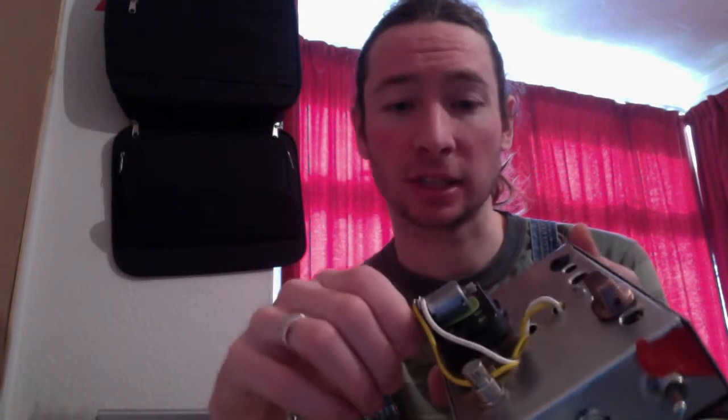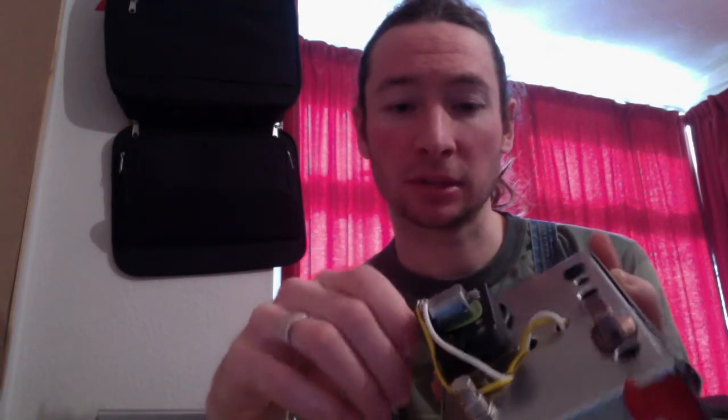Now, these pieces of metal, as it spins, will become closer and further away from the pickup itself, therefore affecting the magnetic field. That speed, creating an oscillation, means that this is actually making a magnetic field effect oscillator. Raymond Scott did a similar thing with light when he made his first synthesizers.